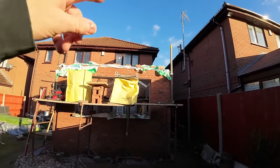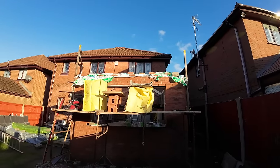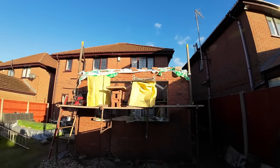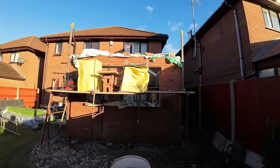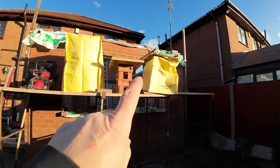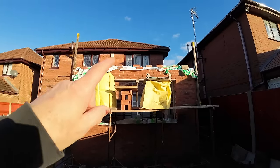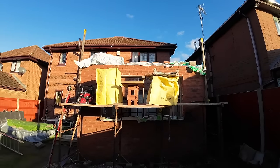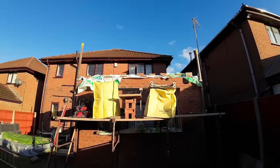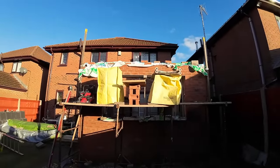So as I said, Neil's got us sorted now, so we need to push on now, otherwise we're holding Neil up. It would be ideal to come back Thursday because the weather's better. It's just warm enough today, but Thursday's a bit better. But we can't wait another 2 days. They're waiting to go now, as you can see. All the gear's here. One of the wall plates is on, and the spar's ready, so they're ready to crack on. And obviously, they can't carry on until they've got a ridge in. So we need to get it ready for the ridge. Even if it means leaving it down and piecing up after, as long as it keeps Neil working. And we can come back and just patch up then.